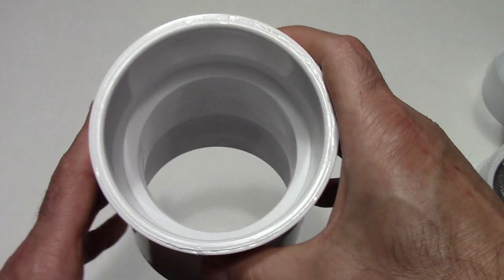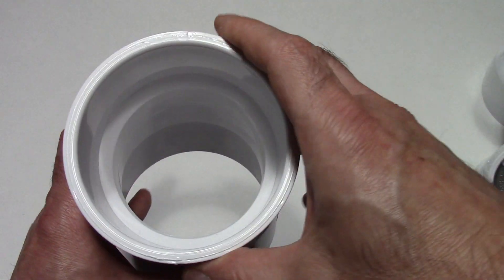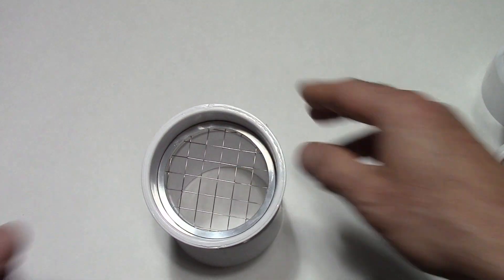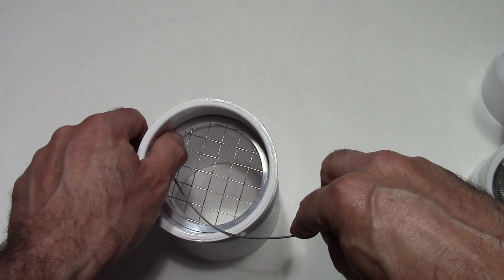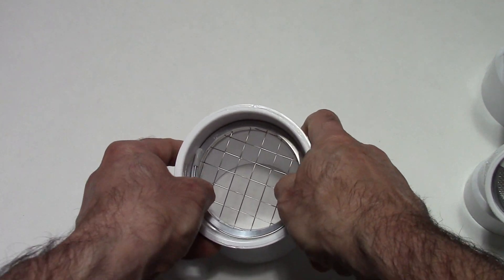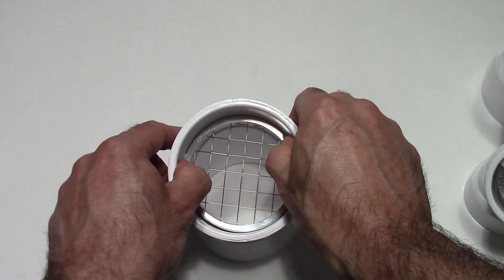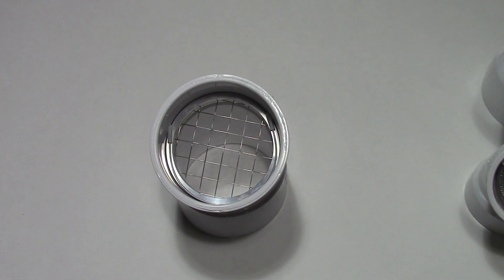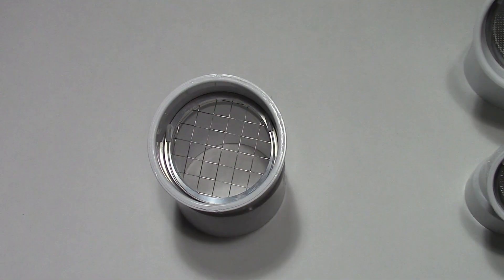If you're putting our vent screens in for the first time, go to your vent terminations and wipe them out with a moist cloth to get any debris out of the way, then dry them up. Once the vent termination hub is cleaned, take the vent screen and simply put it in place — it slides right in. Take your internal wire clip, put one end all the way up against the housing of the vent screen and hold it there with your thumb, then take the other end and feed it in. Once it's in place, expand the internal wire clip and make sure it's pressed all the way back. That's installed. The benefit of the internal wire clip is you can switch over to the insect screen when the seasons arrive, then switch back to the rodent screen when needed.